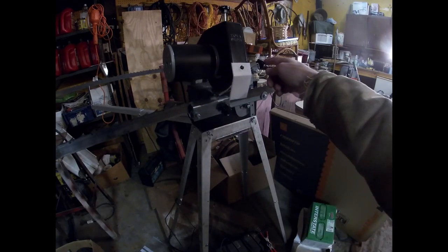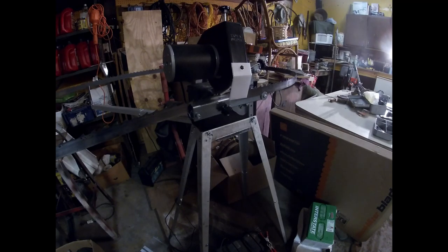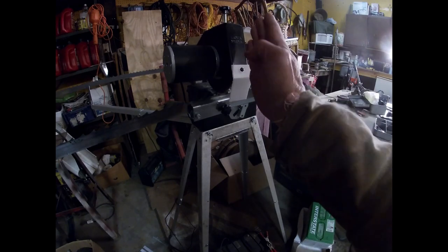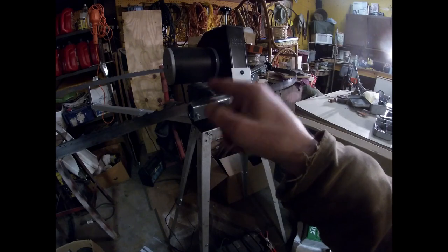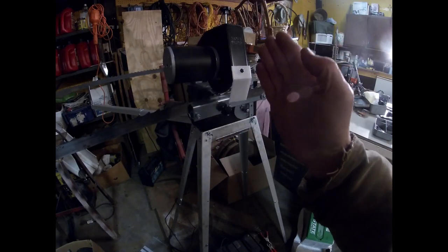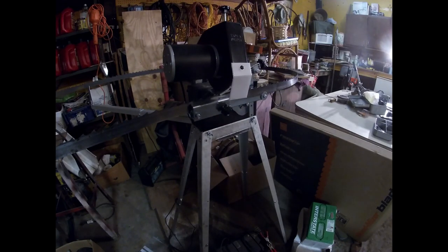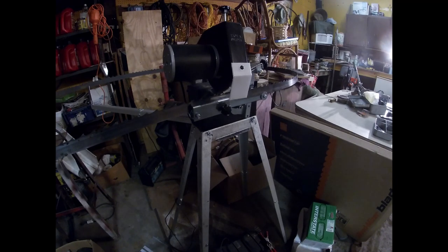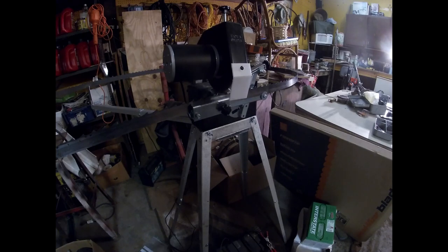I'm probably taking off just a little bit too much of that tooth. You can adjust the head of this so that you can sharpen to whatever degree you want — you can go from 7 to about 14 degrees, you can't go less than 7. We're doing about 8 right now. We're doing some hardwoods and some pine too. The 8 degrees seems to be mowing through the pine pretty good, though knots on the pine might be a little much for 8 degree. But for the hardwoods — I'm doing a majority of hardwoods — it buzzes right through them.